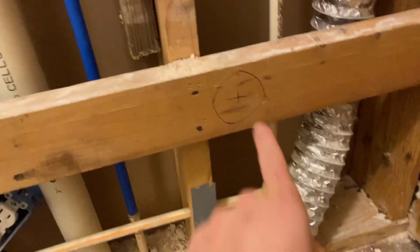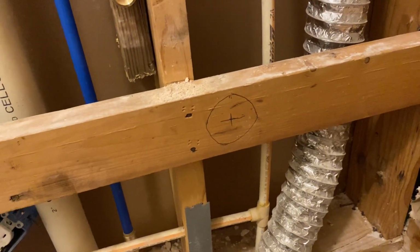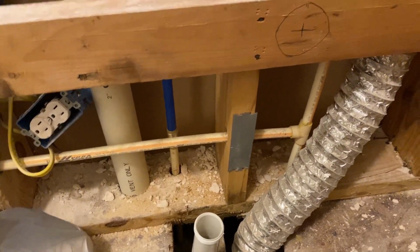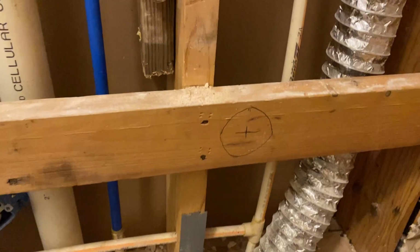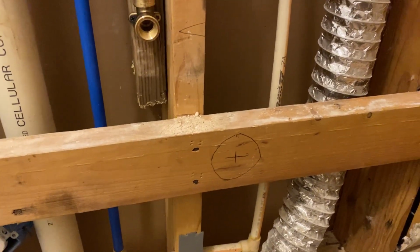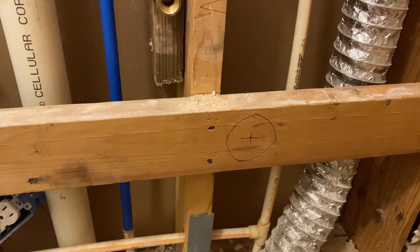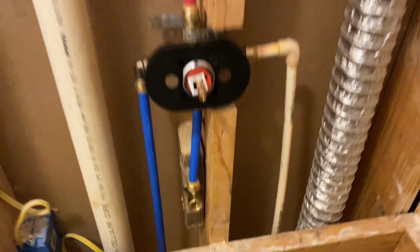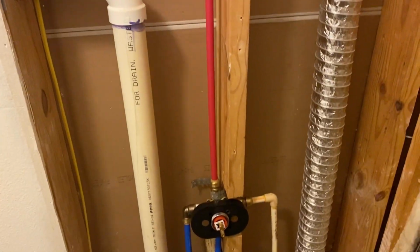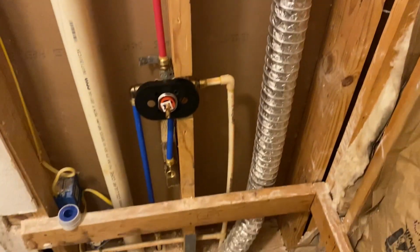And then the same thing, I'm gonna turn the 90 that goes on the back of the tub, I'm gonna turn it and then come down and catch that. The 90 for that overflow, the plate that we picked actually has one screw hole in the middle of it, so you won't be able to tell how it's clocked one way or the other. So that worked out in our favor, but it means I get to undo all of my plumbing and move it over and start over on that.